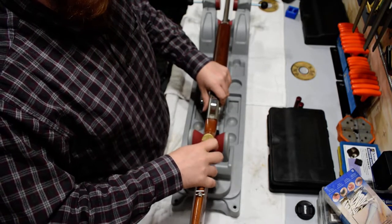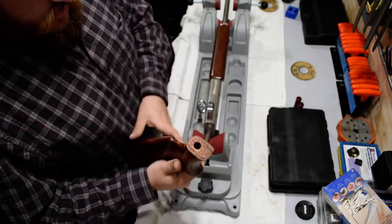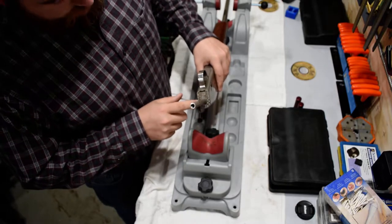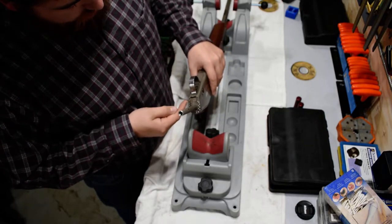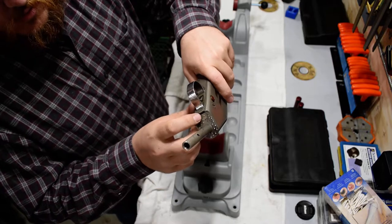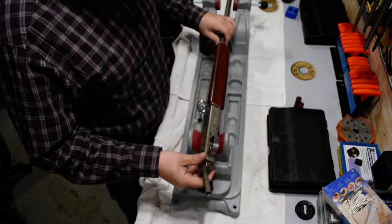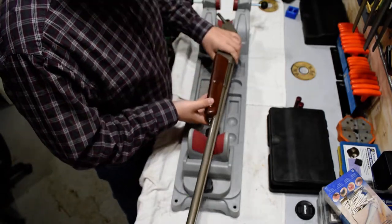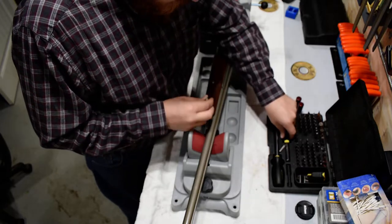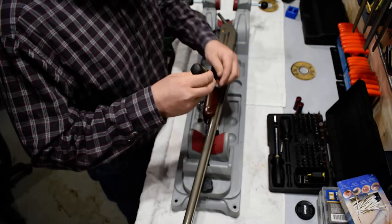It's a fairly chunky screw. The back of the receiver has these little sharp points all over to hold onto the wood. I do not pry against the plate or against this piece right here — somebody before me did and you'll just end up folding some metal. Nothing serious, it just doesn't look good. The second part will be to take the forend off. For these with a slide — or whatever you wish to call it — I'm going to use a Wheeler 141-491 flathead screwdriver.